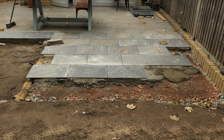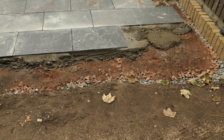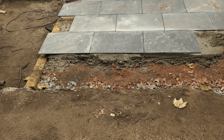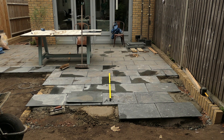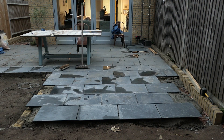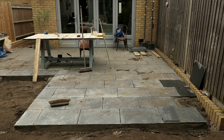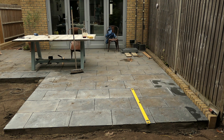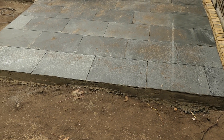I've just got to do the last few paving slabs over here but I think I'm going to run out of sand. I've got one more tile on the second row to do and then it's the last row. I'll then cut some of the slates that go up against this wall — I think I need about eight more bags of sand. I've got the sand now, just to finish off this last row. The last one — great, that all fits well. I've also made sure the edging to the patio is nice and flat and vertical so the rainwater will just drip off.